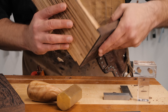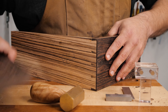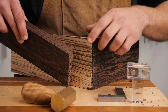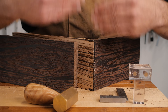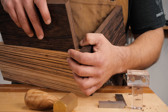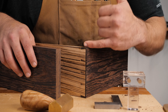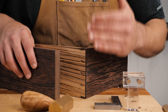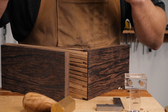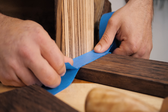What we're going to do is clear out the waste using a fixed base router. I'm using a quarter inch spiral upcut bit from BitsBits - there's a 15% off discount code in the description. We're going to set it right to our depth line - right on it, maybe leave a smidge just in case - lock it in. Then we're going to make sure it stays flat and just clear out our waste. If you have trouble seeing your lines, darken them up with chalk or white pencil.